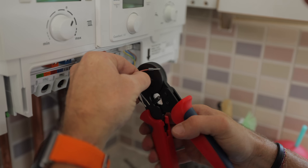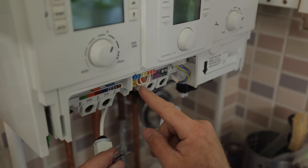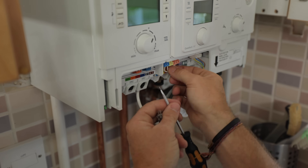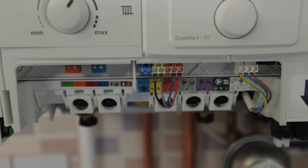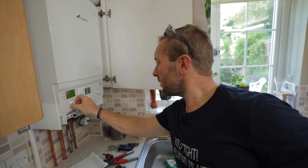Hold on — I know we're under a time limit here, but we can still do a proper job, can't we Max? If you like this kit, I've got it linked in the Amazon store. So we've got these two links here — there's our live out, and these are our switch lives back, so we just need to cut into those. We're basically interrupting these supplies now. By interrupting them with the switches inside the programmer of the Tado — that one and that one, these will pull out. So our normally open central heating is grey, and our normally open hot water is black. It says now put the cover on, turn the power on, and then we've got to wait for 30 seconds. All right, while that's doing that, let's get the heating system drained down.